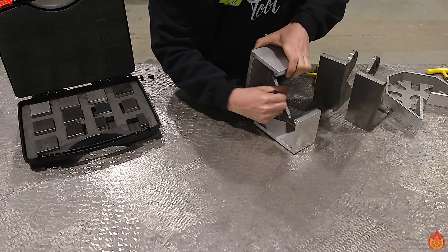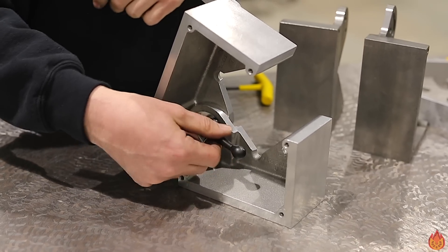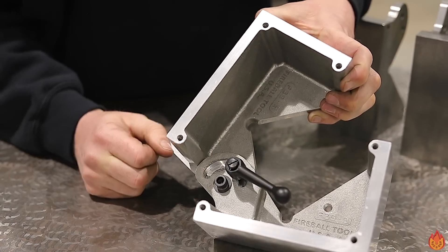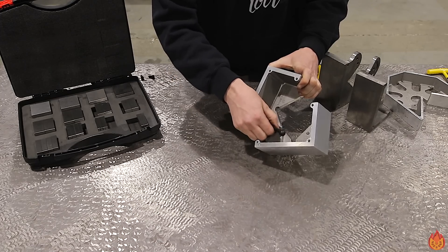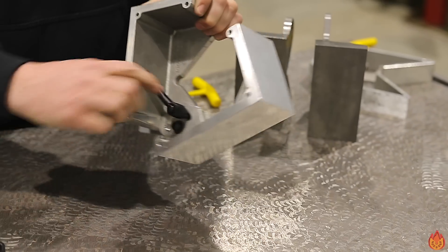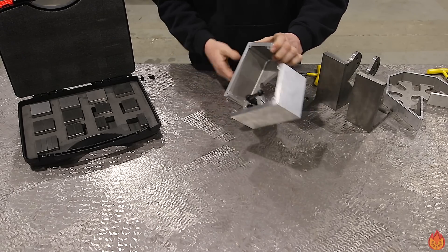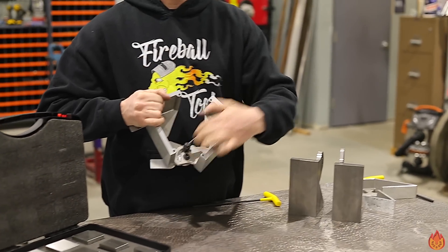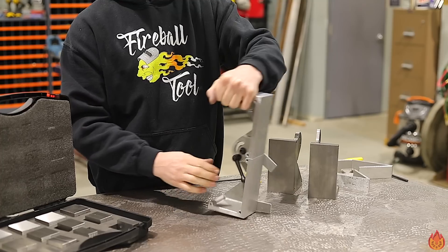The handle, like I said, has tool-less adjustability. The handle is metal, so it's going to hold up — it's not going to snap off, it's not plastic that could melt. You can adjust it any way you want; if it's in the way, just rotate it out of the way. Or you can unthread it and put a socket head cap screw or a normal bolt in there for whatever job you're working on. It doesn't jiggle around — it stays where it needs to. The beauty about this style clamp with the slot is you can really put the pressure on. I've stood on these corners before and it doesn't move — it's really, really strong. And that's not even with the center bolt locked into place, so you can rest assured it's going to hold your angle. And of course you can loosen it by hand again.